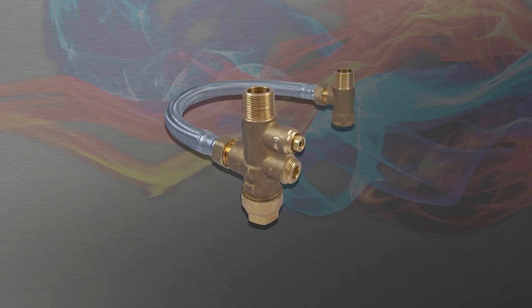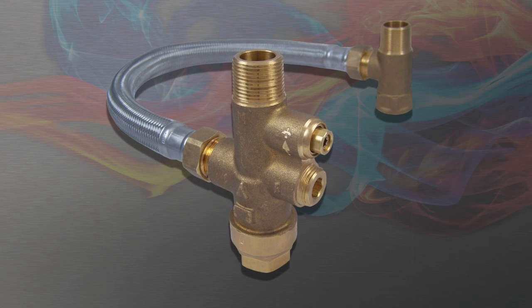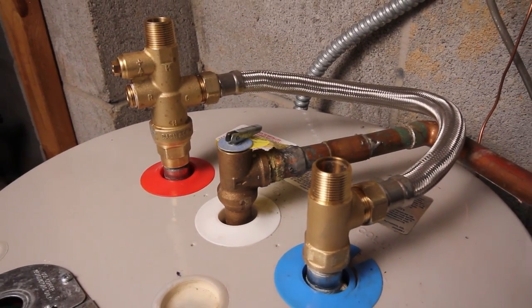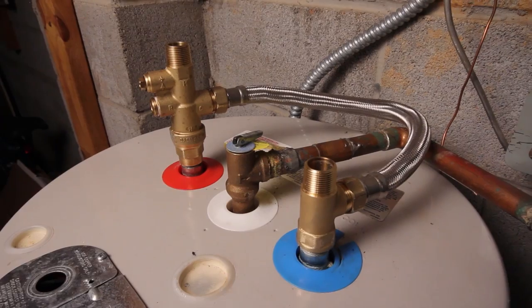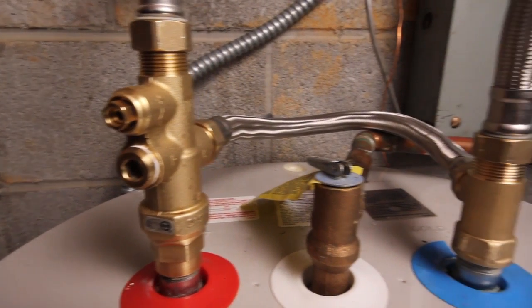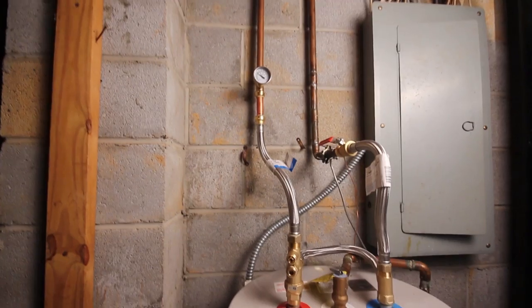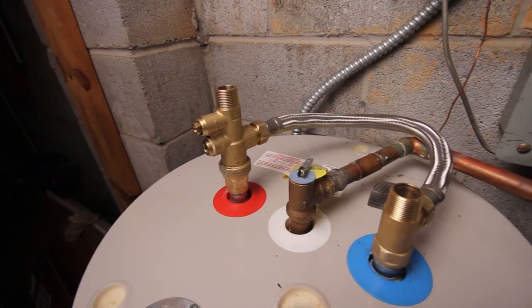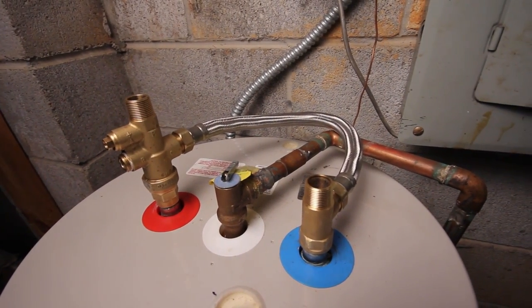My name is Craig and this is a training video for the Heatguard MultiFlex Thermostatic mixing valve. This innovative valve allows water to be stored in a water heater at 150 degrees Fahrenheit, which kills Legionella but eliminates the risk of scalding, as the valve reduces the water temperature to 120 degrees Fahrenheit by mixing in cold water at the outlet of the water heater.